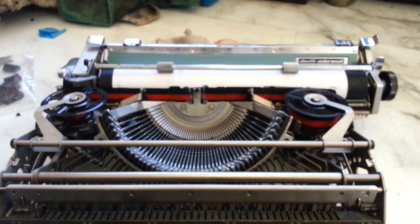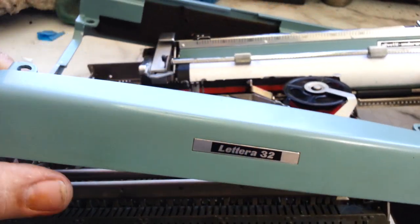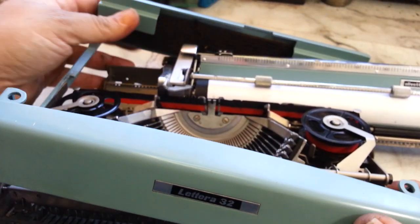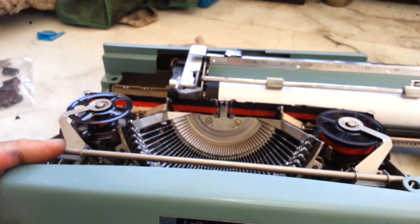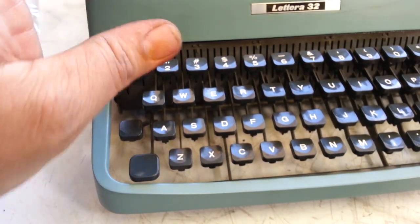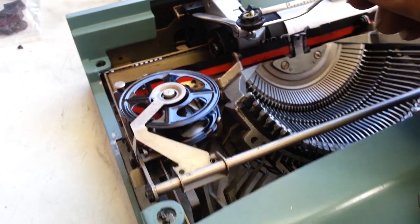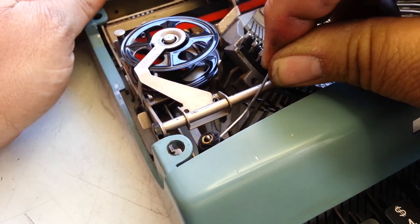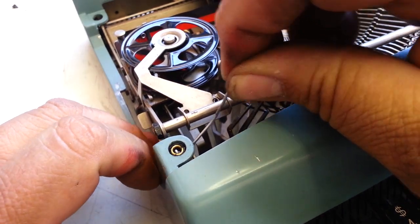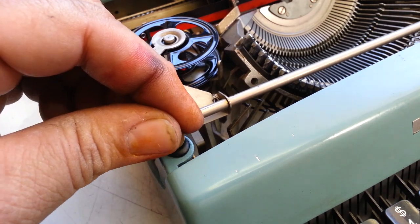So here's the lid. When the top case goes on, I can stick this back together like this. The only way I could figure out how to get these grommets in place was to build a little tool. So I made this tool right here that holds the grommet like this, so I can stick it underneath here and get to it. I can raise this up just a bit, do this on all 4 corners, drop it back down, pull the tool out, put the little piece on top like that, and put the screw right through there.